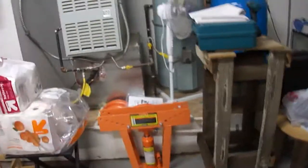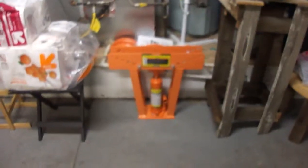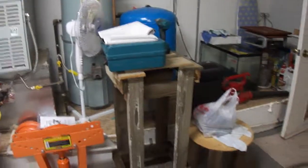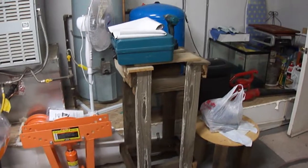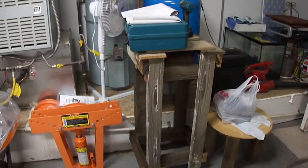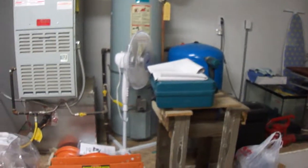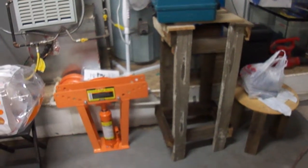So that's that. That's the bottom frame. That's the top frame. That's right there. That's all going to get welded on Saturday. And that's about it. Oh, another thing though with this tube bender, of course, I needed room because I'm bending over 200 centimeters of metal. So I built this little thing. The fence broke out back, so I took the wood, the 2x4s, and constructed this little stand right here. I put that tube bender right on top of it, and it gives me all the clearance that I need.